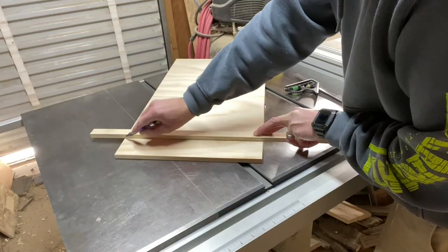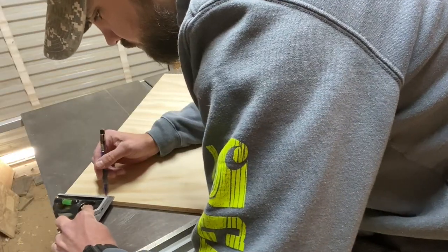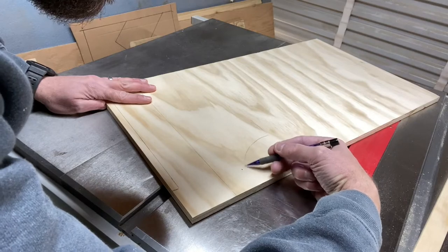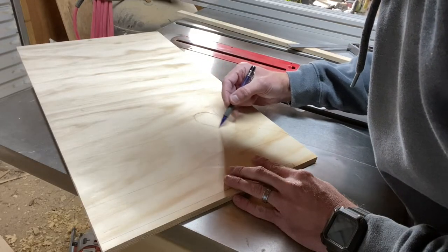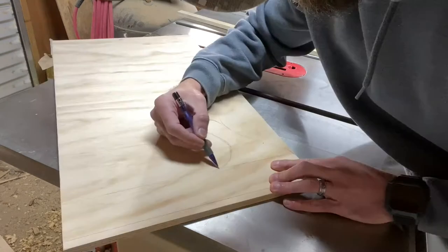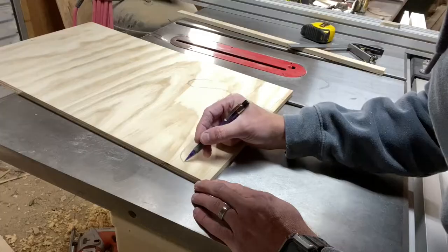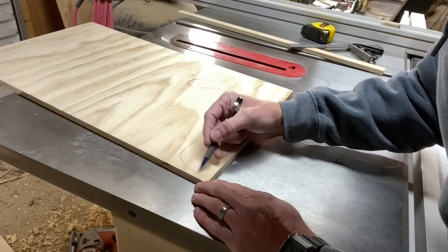For my next attempt, I switched to using half inch plywood. I decided to use plywood because the alternating direction of the plies means the wood grain directions will be alternating, so there will be strength at the bottom of the handle to reduce the possibility of it breaking. I also incorporated a more rounded corner of the handle base so there will be more material at the vertex of this angle. I also like the design much better.